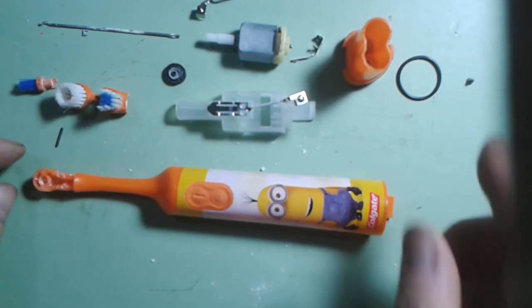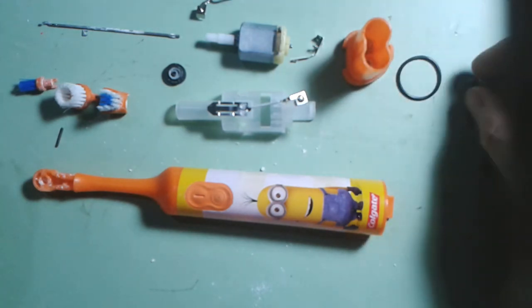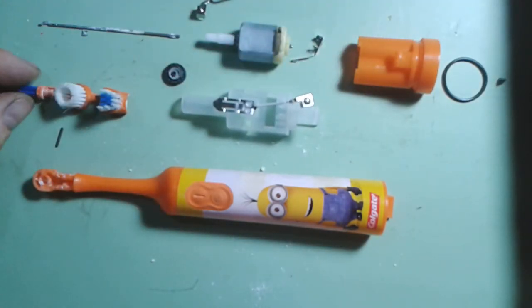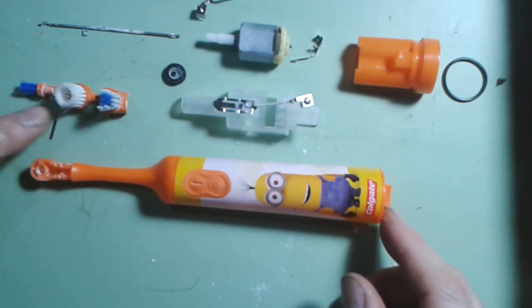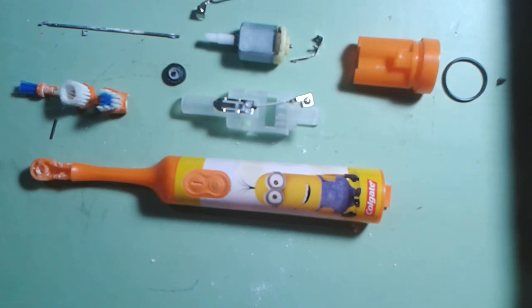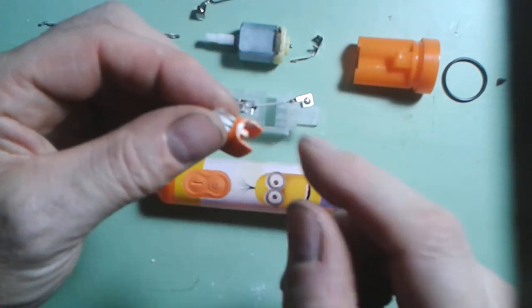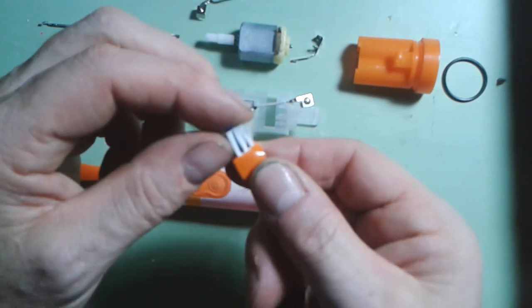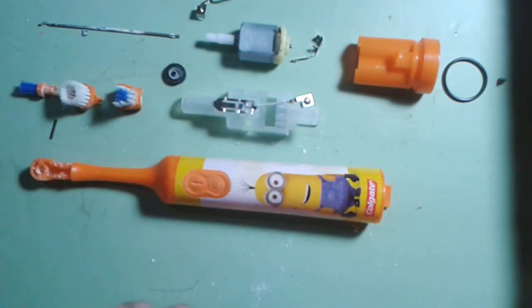What you would be expected to do is draw the individual components in such a way that you could see them — showing how they would come out of the machinery. Lay them out in a logical way, make them fit the paper, and you can see how the pin lines up with the head and the piece holding it down. Look at each piece, draw an overall view, then draw each piece carefully and annotate it — deciding whether to draw an orthographic or isometric view — and label it with the materials you think it's made from. And that, ladies and gentlemen, is what powers your electric toothbrush — in this case quite a chunky motor, though in other videos you'll also see they sometimes use very tiny motors similar to those in mobile phones.